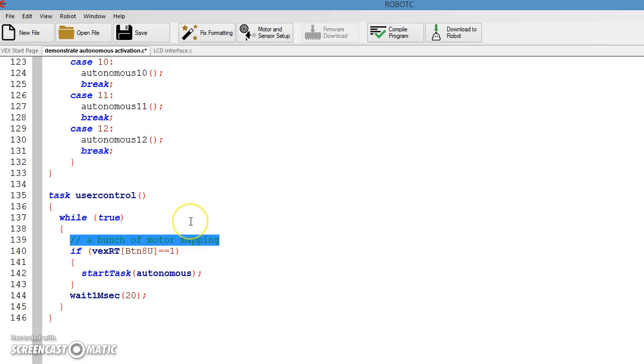So there are two streams of commands that keep sending those things to the motors, and it's basically updated every 20 milliseconds. So we'll see the robot keep glitching. Like something tells it to go forward and then stop, go forward and stop, and it's updated every 20 milliseconds. It's going to be horrible. So we need to do something else.